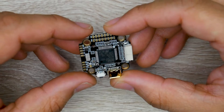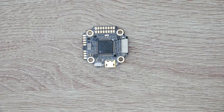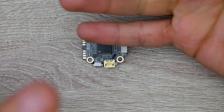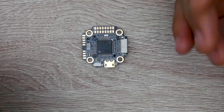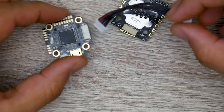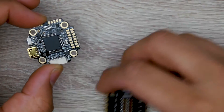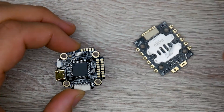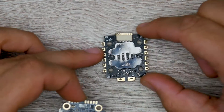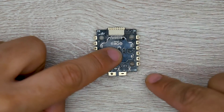Let's cover the connection setup — receiver setups whether you have S.Bus or I.Bus (Flysky or FrSky), the video transmitter, and the camera. The ESC connections and power are all routed through the connector cable which connects the two boards. When installing both in your quadcopter, make sure you install them in the correct way or your quad will never fly. The ESC would usually be under the flight controller, with the camera connector facing front.